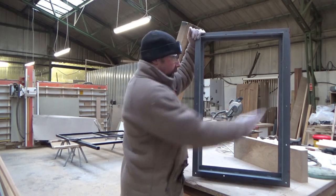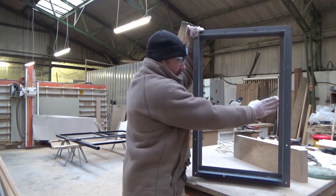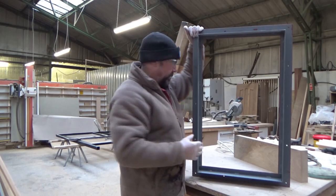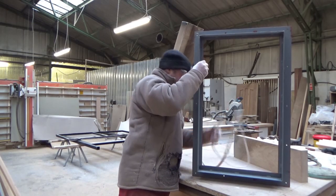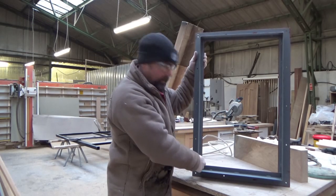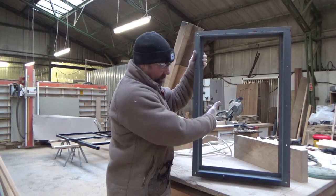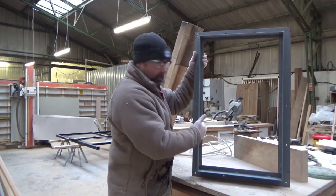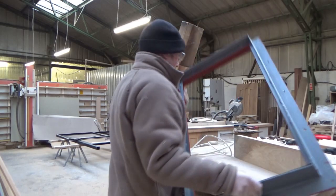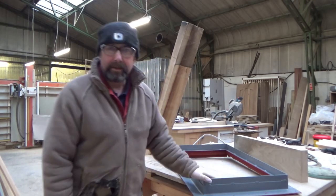Then what we're doing is the timbers that go around here, so the door closers, the wooden panels in, and the side timbers, bottom and top, have the seal, which is this, which we machine a slot in the side of the reveal timber, so the door hatch closes up to the seal and squishes it, and it gives you a good seal. A bit of weight in those, so we'll be doing that today.